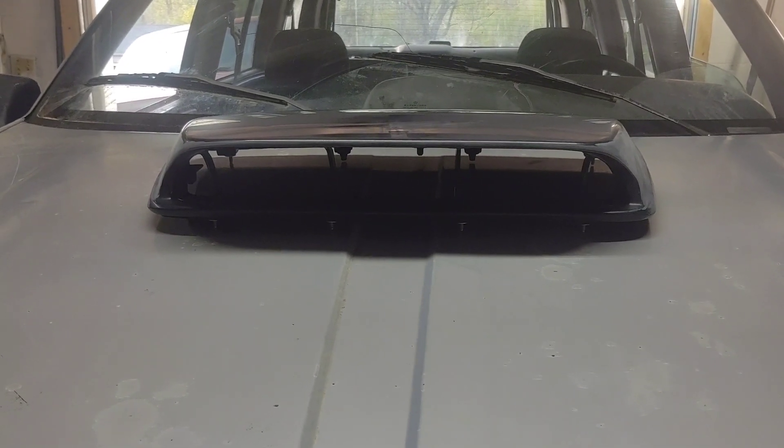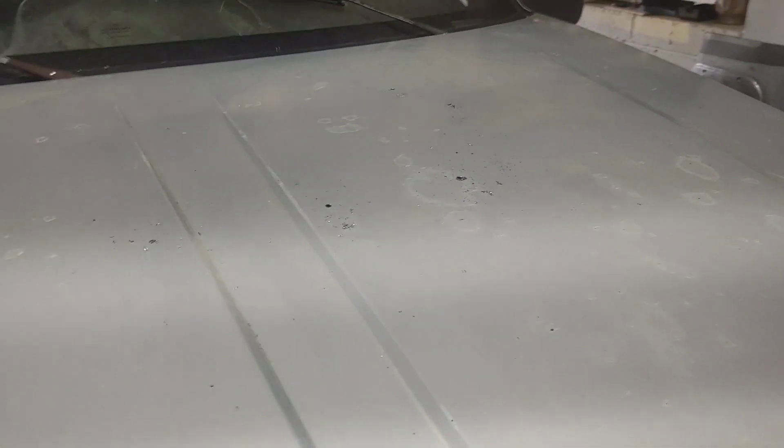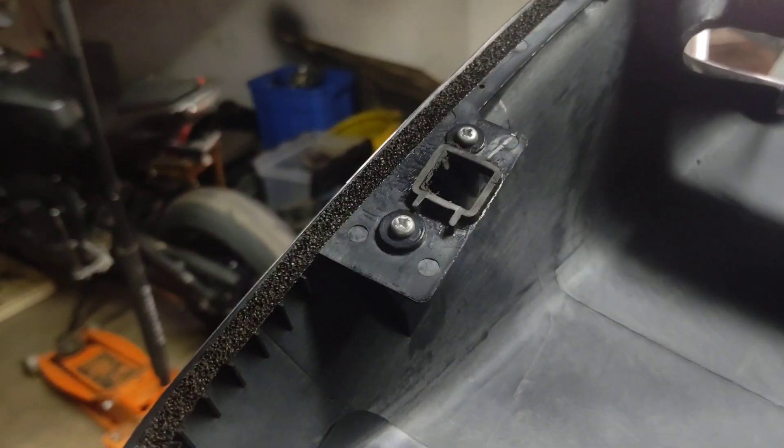Let's get to it. Moving through it pretty quick. I just set it up here and scribed around the bolts. After lining it up and getting it close enough, I shaved these off. I left them sticking up a little bit so it would stick up about as much as the other pedestals.